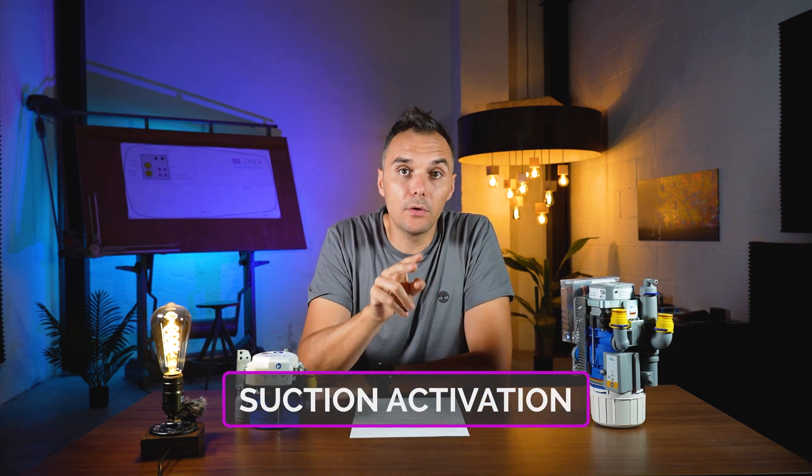All motors need a suction activation wire that runs from the machinery room to the dental chair, to send a signal that allows the motor to start and stop. Mostly this signal uses a clean wire connection with no voltage on the two wires. However, in some dry suction systems and some liquid suction systems, these two wires also carry electricity to power the suction motor. In that case, a RLA relay must be installed to divide the electricity going to the motor from the signal going to the suction cannula — otherwise it would be very dangerous to put 220 volts in the assistant tray.